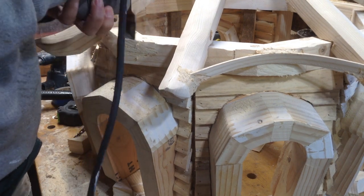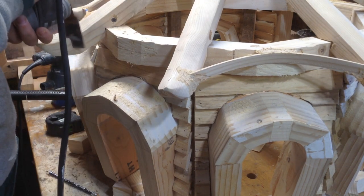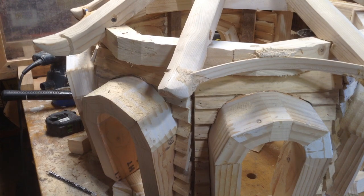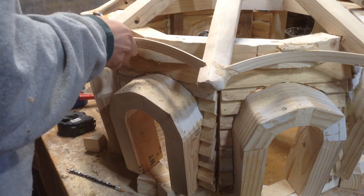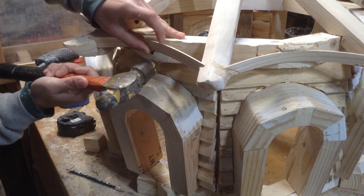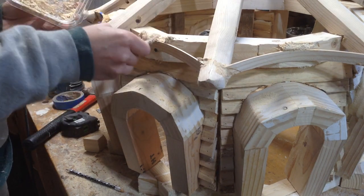When I started thinking about attaching roof pieces, these two parts sticking out got in the way. Not only did I cut those off, but I also trimmed the front. I decided I wanted the bottom — essentially the fascia — to be a curve. I'm just going through and roughly making marks; this isn't a house, it doesn't have to be perfect. I'm cutting out a kerf there, and then I have thin strips of pine that I can slide into place so they sit against that flat portion in the back. I use a mixture of sawdust and putty to hold everything in place. Once the roof pieces are on and I fill the void in the back with a little spray foam, they end up very secure — I'm not nervous about them cracking over time.